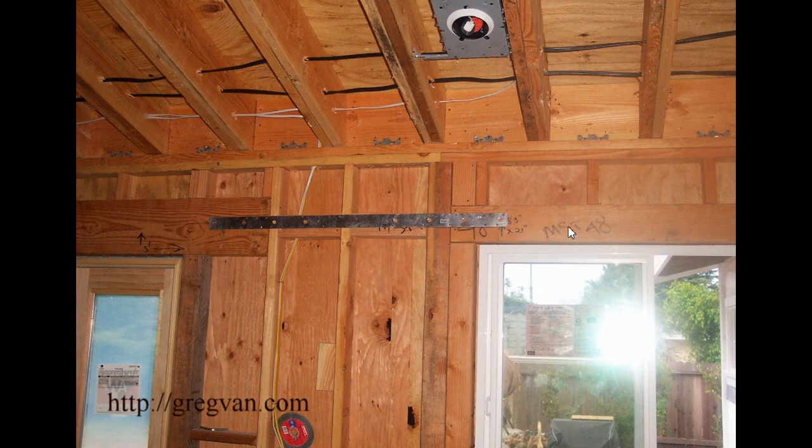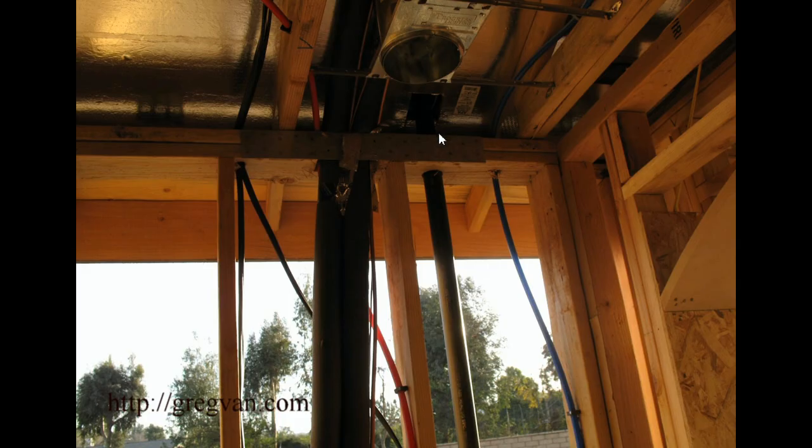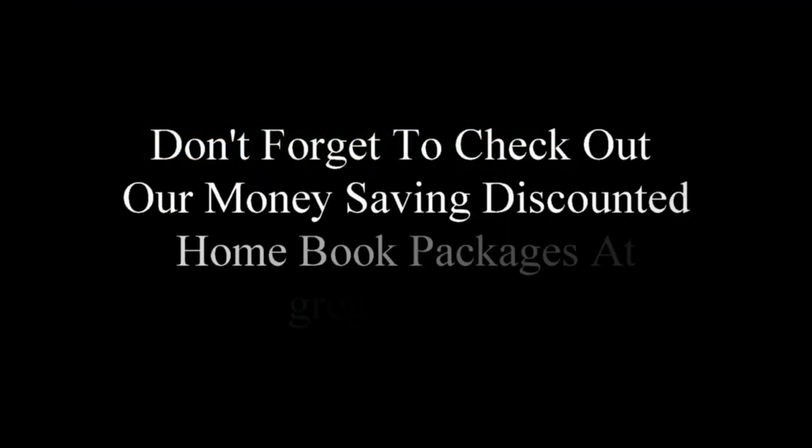This was always something I wondered about — why we needed to install these in newer homes when we didn't put them in older homes, and a lot of those older homes are still standing. I guess once we get the big earthquake, we'll find out about that. Anyway, my original reason for making this video was just to point out that I don't think it's a good idea to have straps in here with nail holes, because a drywaller could end up driving a nail into one of these holes and right into your pipe. That wouldn't be a good thing. Thank you.